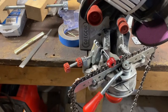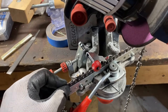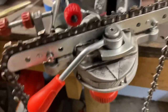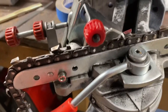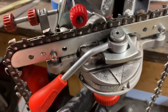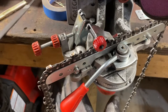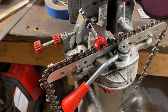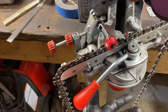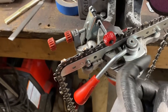My 325 chain, I think that's 30 and 60 as well. I did have a saw before that took chain requiring a 20-degree angle. You've got to make sure you're cutting in the right direction — right-hand cutters do one side, left-hand cutters you turn it the opposite direction. One mistake I made early on: when I'd set the tooth depth and figured I'd just cut them all the same depth, then just turned it to do the left-hand cutters — I found out that's not the right way. You need to reset completely as far as your depth of grind each time.